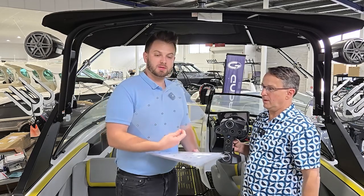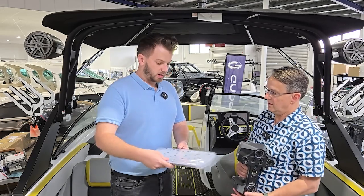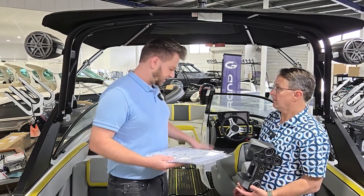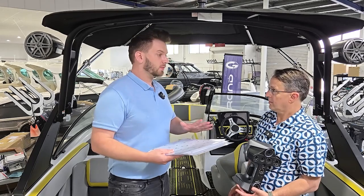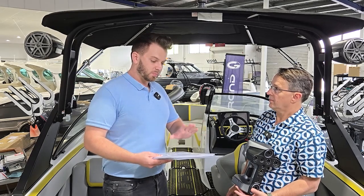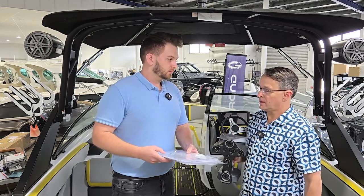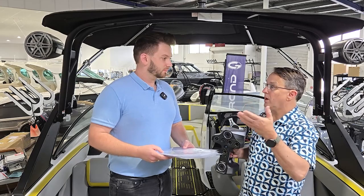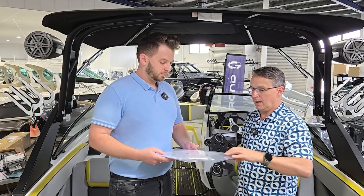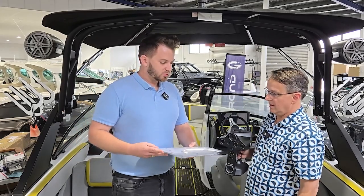We've got these markers on a clear plastic sheet. We're going to be using these over the entire floor of the boat to give the scanner more references to work from. This boat does have flooring with some colors and textures, but often it's just a very flat surface, which creates problems for the scanner. This way we don't have to spend an hour or two putting individual stickers down — we just pop these sheets down and get going. And these are reusable.